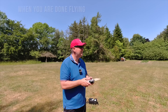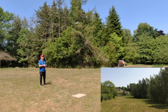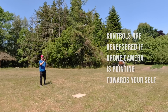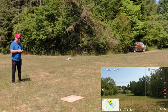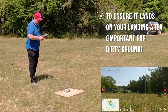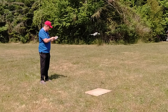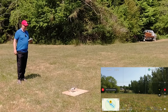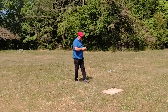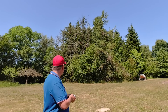Once it's time to bring the drone back, simply bring it back to the takeoff position. I normally go behind the drone, position it above the landing pad, and make sure I can see the rear of the drone because then the sticks react intuitively — controls would be reversed facing the other way. Simply lower it above the landing spot, then land the drone by pushing down on the throttle stick. Another way is to use the land function in the DJI Fly app — just press land and the drone automatically lands wherever it's positioned. I prefer manual landing and would recommend the same.